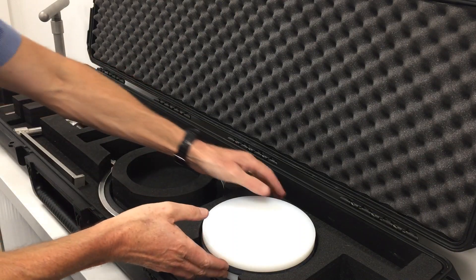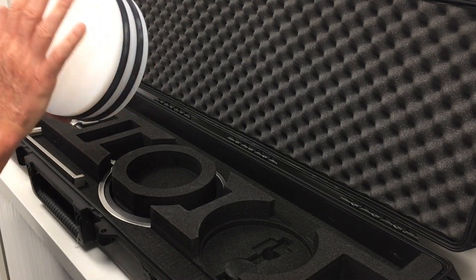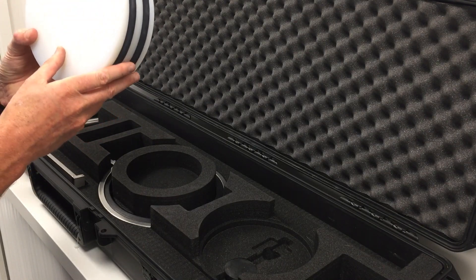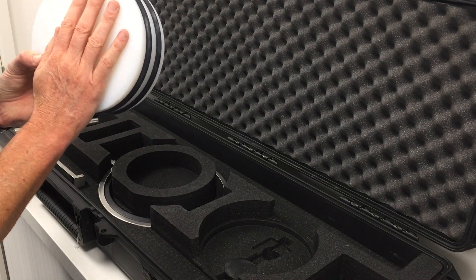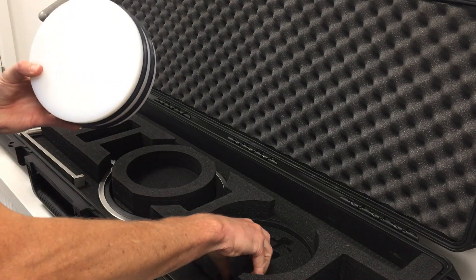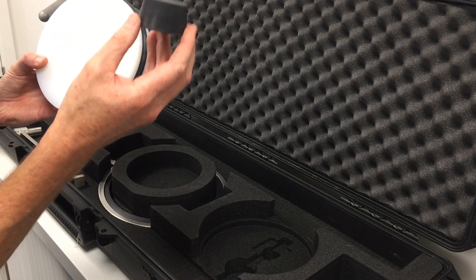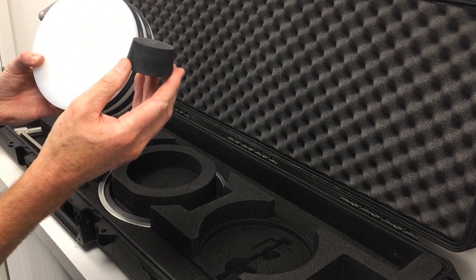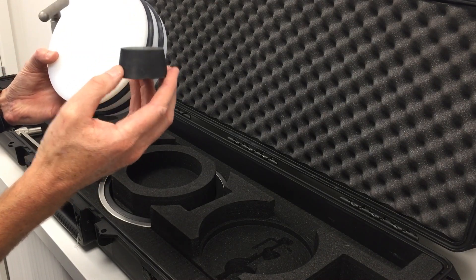And finally we have an 8-inch pig. The 8-inch pig block is designed to pick out very difficult to remove membranes using hydraulic force — water. Accompanying that is a rubber bung to put into the port of the membrane vessel to prevent any water loss. Generally water is used at low pressure but high volume.